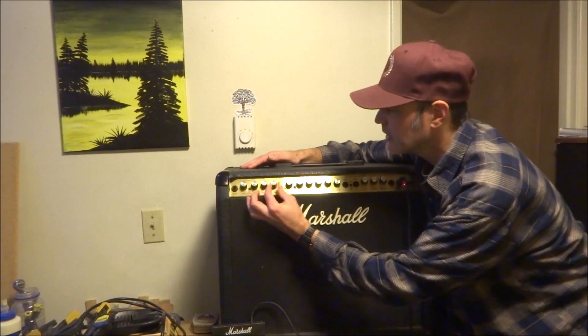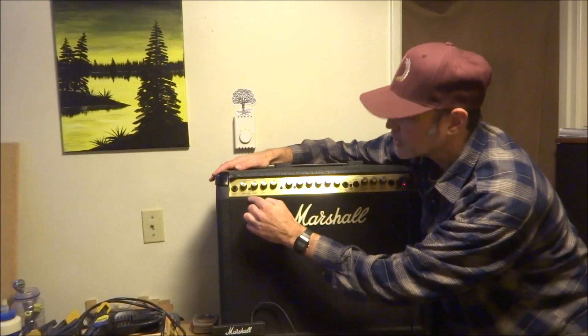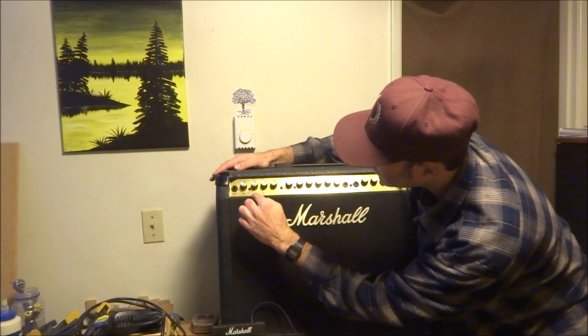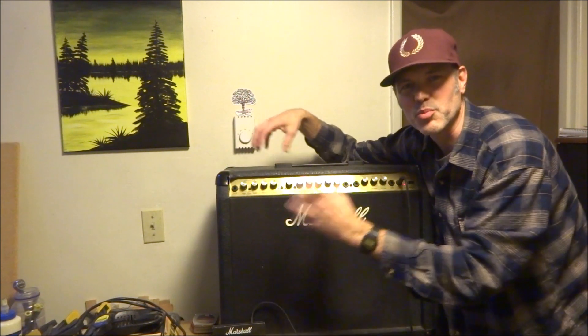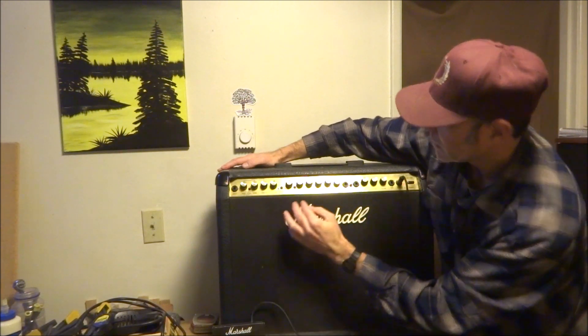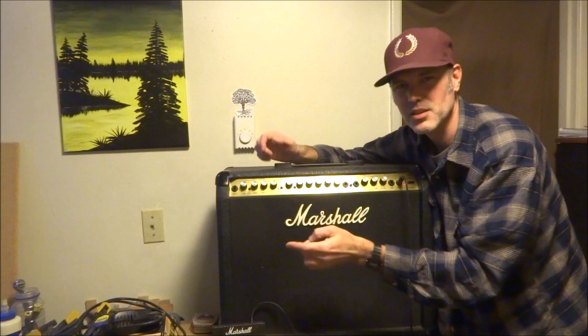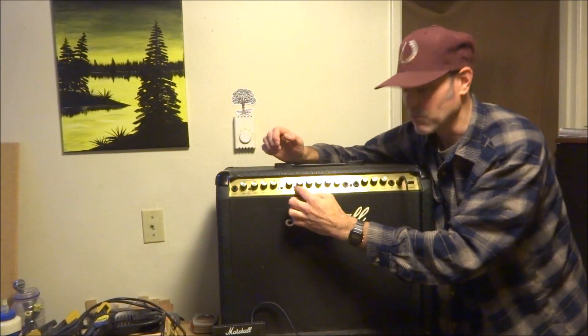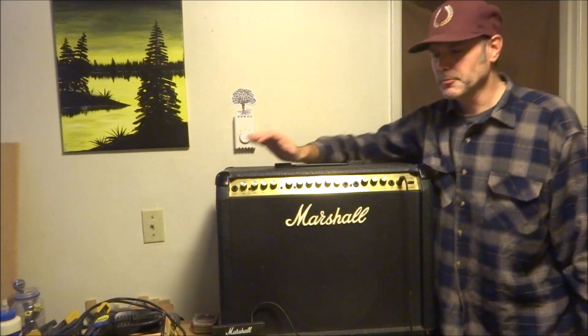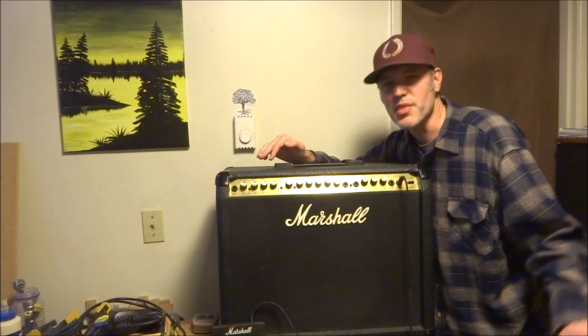Let's put them all at 12 o'clock again. Right now it's on the clean channel with nothing plugged in. Let's hear the clean channel with the boost — no difference at all. This does engage the little tube in the preamp that gives the distortion. On the boost channel, again there's no change in the noise. With the gain up as loud as it can go, there's still no more self noise. But with different guitars and different settings, there will definitely be different buzzes — especially with single coils.